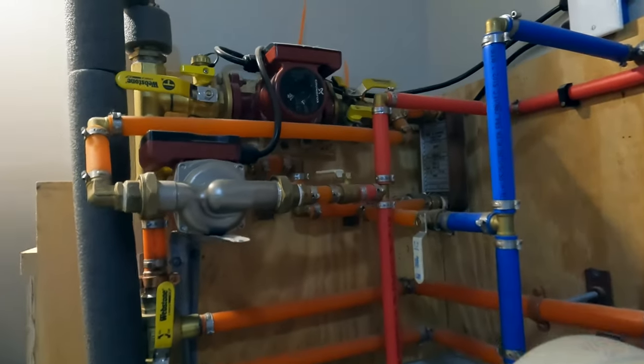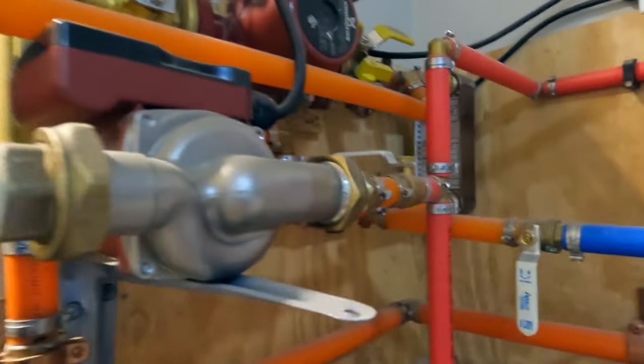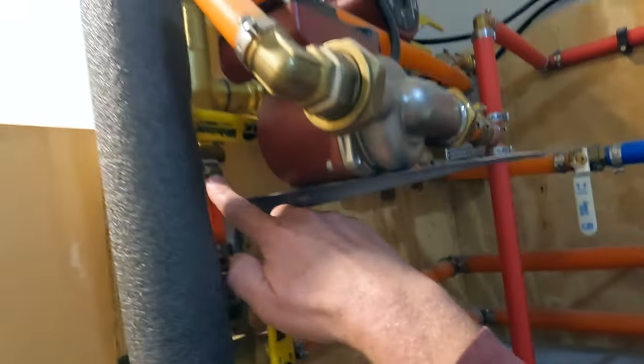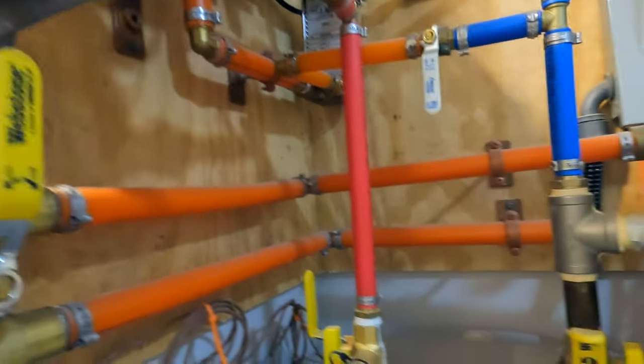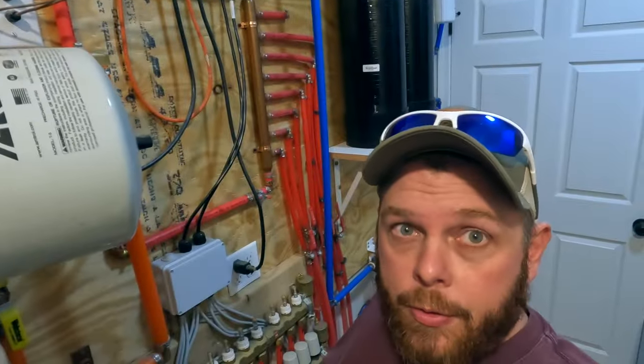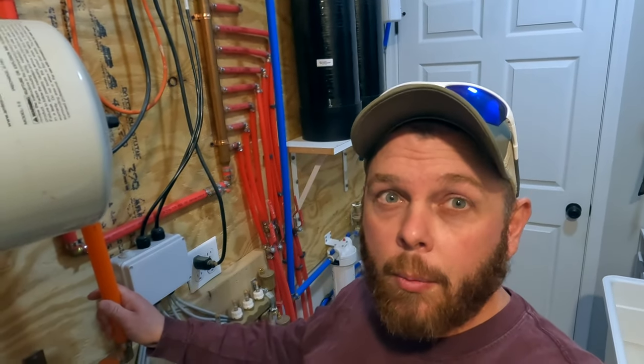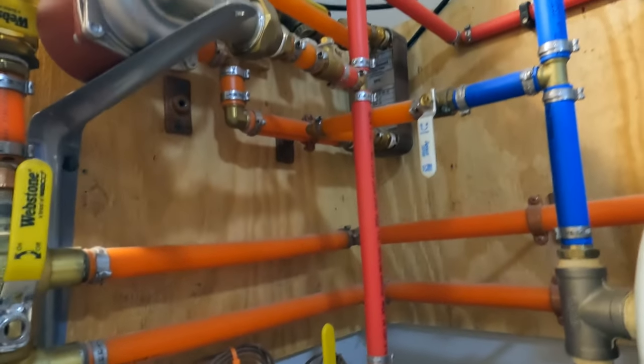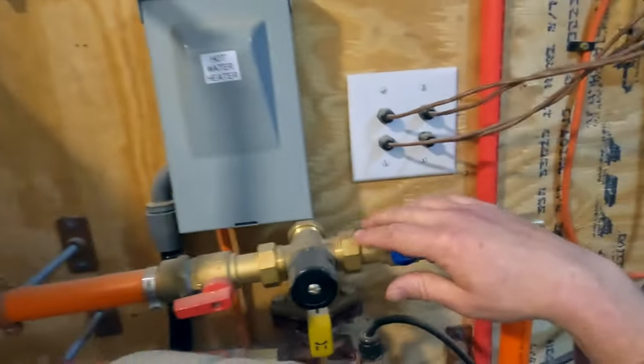The first stop up there — that first pump is my heat exchanger for the domestic hot water. So the water comes in, hits that pump, pumps through one side of the heat exchanger, back out, comes in through here, and then it goes into the floor. There's a little temperature drop in the water going into the floor. If the water went into the floor first and then to the hot water, you'd never get hot water because it comes out of the floor at about 70°F. This top line is the water in — it comes over to that thermostatic mixing valve there, which I have set to 130°F.